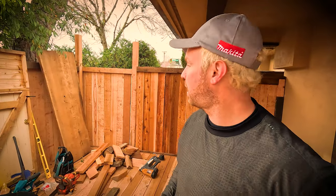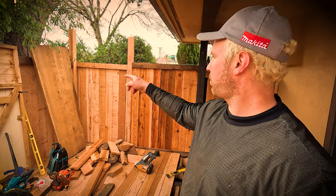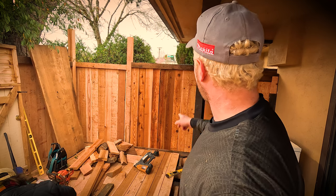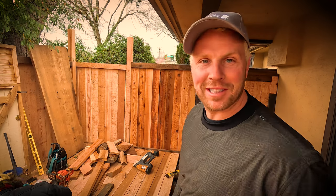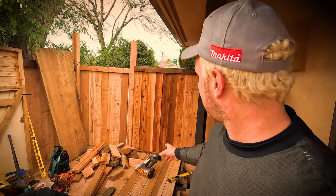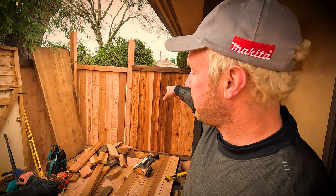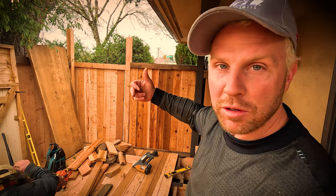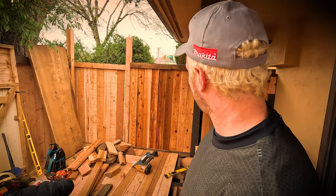So it only took 8 panels, but I got it so it fits. Well, there's a little bit of a gap there, but whatever, it still fits. Yeah! Forgot to turn it on. Sorry about that. But now it's a really tricky angle, so instead of using the nail gun, I'm just gonna come from behind with screws and screw them in and then tack them from down below.